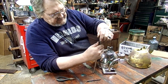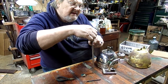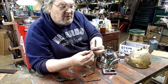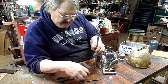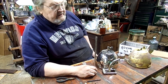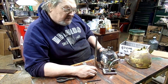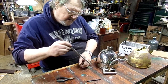This is how Coleman handled it, and it's pretty ingenious. The orifice screws off, and the first thing you've got is a little filter cup — can you see that? It's a little tiny cup, has a piece of screen in there and two holes in it, and this is the last thing the fuel goes through before it gets to the orifice. When I was messing around trying to build a super generator I didn't understand this technology — I just used a raw tube and I couldn't get my fuel to vaporize correctly. But this is how Coleman dealt with it.